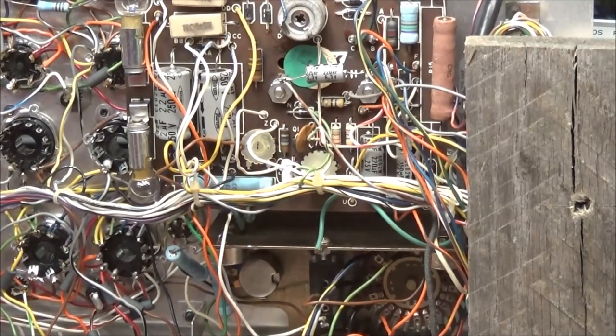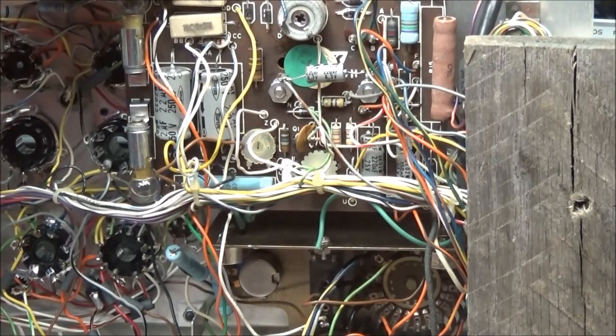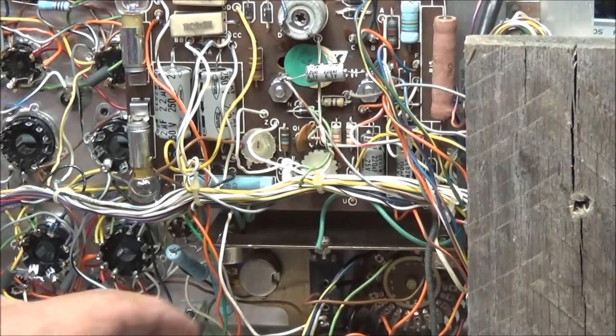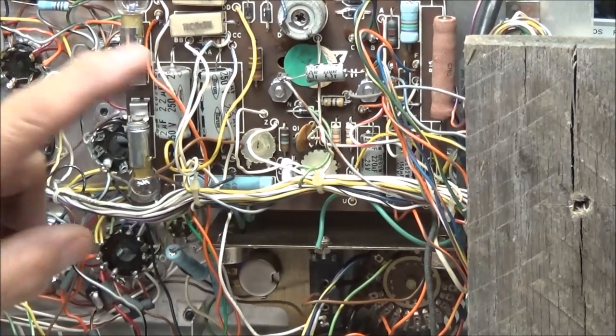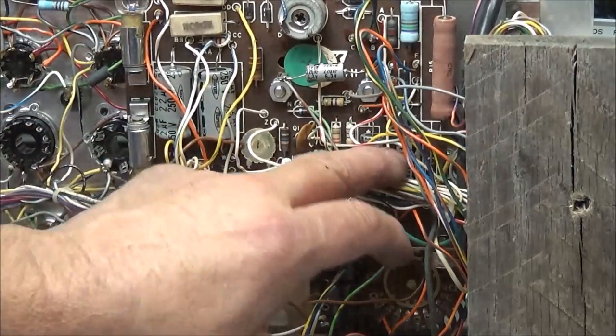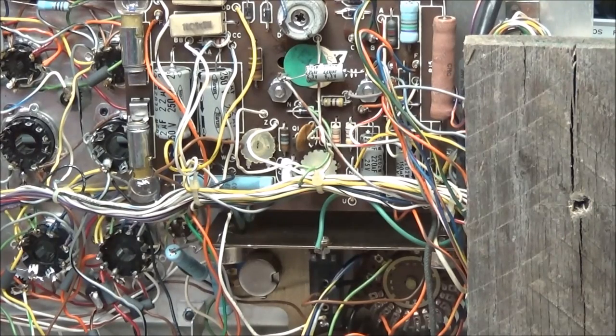You can see a lot of electrolytic capacitors on here and also some resistors. There are two cement-style resistors that have been completely overheating — they are 180 ohm 5-watt resistors and they're so bad the writing is just about faded off. You can see a lot of other big power resistors in here too. The game plan is to get this board loose and go ahead and get these electrolytic capacitors replaced first. I think there are five in here.